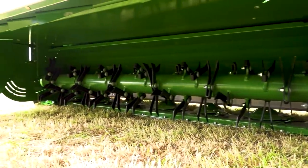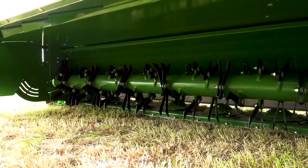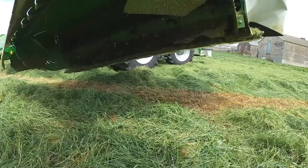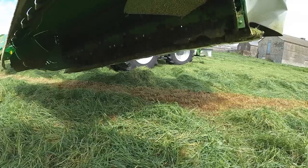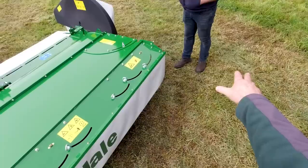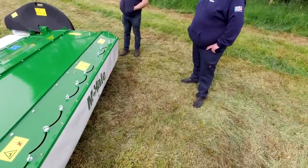Looking towards the back of the machine, you can see we have a steel tine conditioner. Under the hood, we have a conditioner which is free-hanging — it's not held from the top, so you get a lot less wear. When you fire up your conditioner, the tine itself locks back against the rotor. You've got spreading vanes at the back, so by simply opening up your swath boards to full width, the conditioner tines will push the grass against the vanes and give you a full width spread. This side of the mower is square so it stops you throwing grass into the uncut crop, and the other side is tapered out at an angle so it marries in with the spread of the front mower. The complete ground is covered.